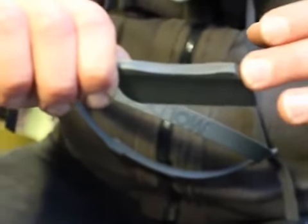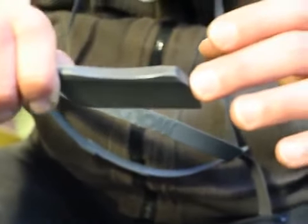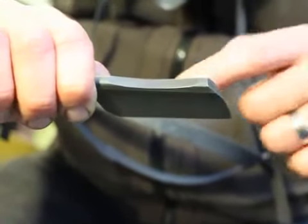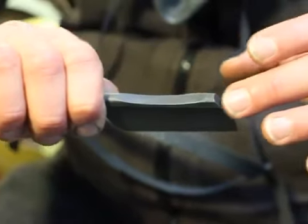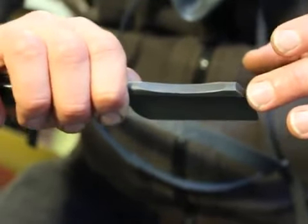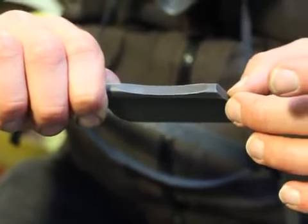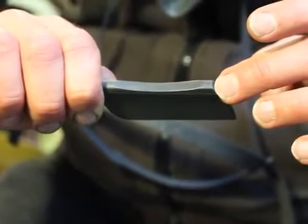Furthermore, the benefit of doing it like this is that if the geometry is not yet entirely correct, this process will just make more foil where the geometry is sticking out. So by the end, not only will this edge be straight, the geometry will also be correct, and the bevel will be very thin.